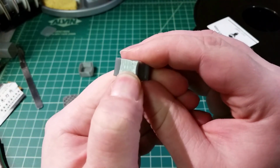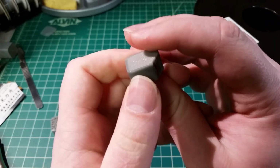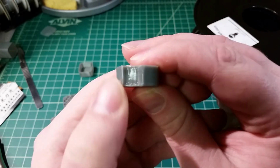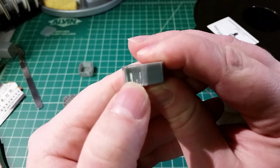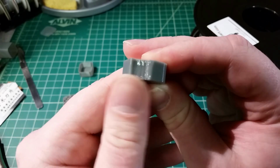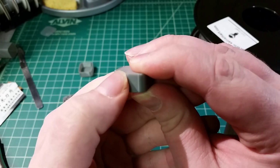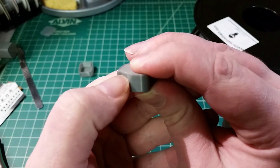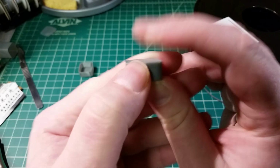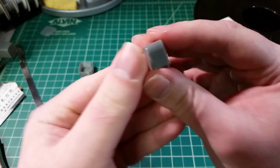As long as there's enough support, you can get away with doing that. And it's not as easy as acetone on an ABS print or anything like that, but you can get away with it. Now you see here, where I hit the infill, that's rectilinear infill, so there's a lot of airspace behind each and every one of those little extruded lines, and that started to cave in under the heat. And that's what I've seen with prints printed up in TPU that don't have enough infill or shells when you try to warm them up. But that is one interesting way to finish a TPU print.